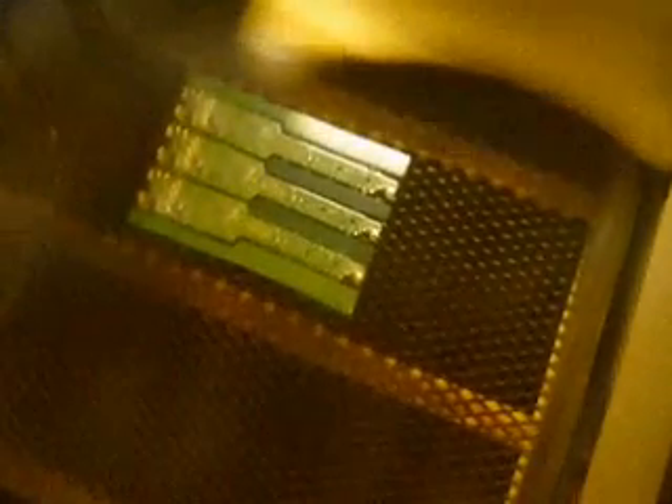The reflow process is concluded. The machine automatically times through the process and at the end of the reflow process, through the period of liquidus, the machine will automatically cease heating, bring the circuit board back to the surface, and the shutters will close behind the tray.